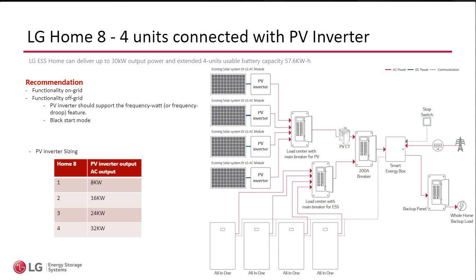If the power outage is extended and we have more PV than we need for the house, you can imagine that we're going to get to a point where the batteries are at 100%. The house loads are taken care of, but the PV inverter's job is to keep pushing the current, right? So what we do is that we deploy an architecture called frequency shifting,